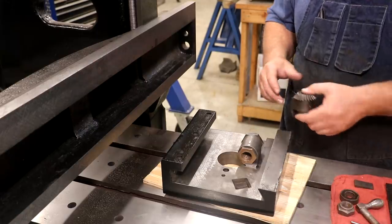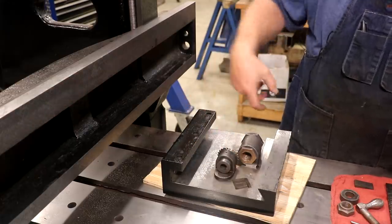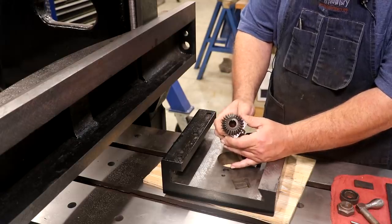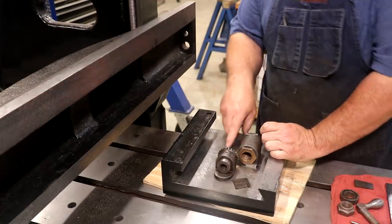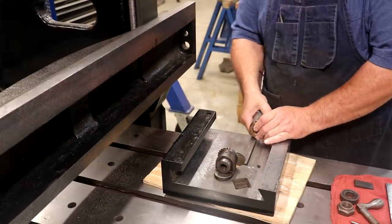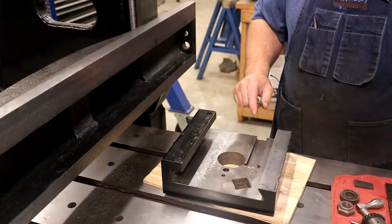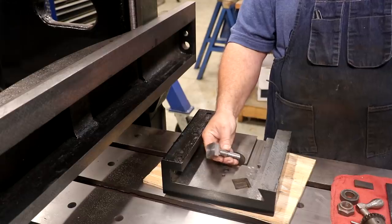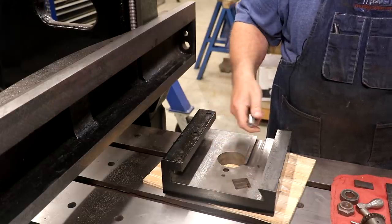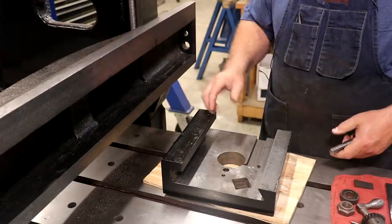The other piece on this back side is this gear — it fits in right here. There's a hole that indexes it in and a screw that comes from the other side to tighten it up. There's a key in that bevel gear, and as the rod turns the bevel gear turns, engaging into a bevel gear from the clapper box to allow it to move up and down. There's also a square hole here — we made new t-nuts that hold the clapper box assembly on, and that square hole gives access to get in there for the t-nut to be captured on the inside.